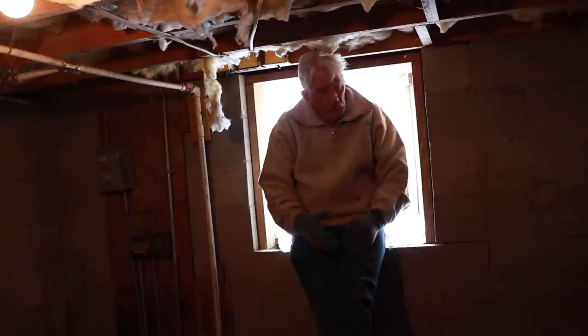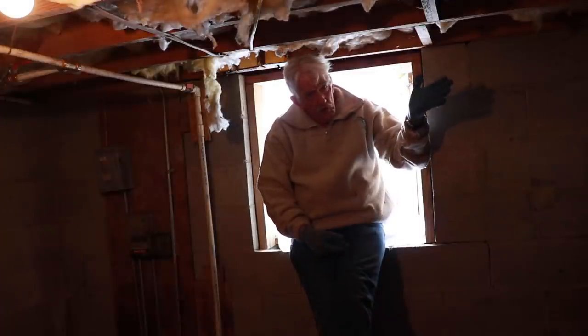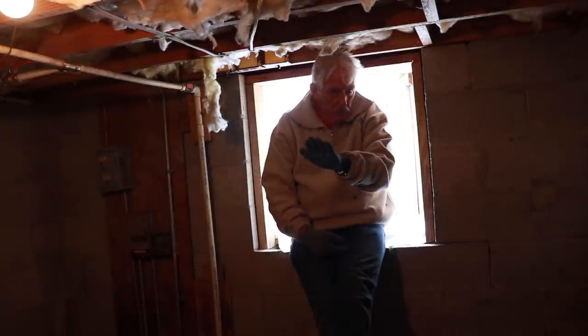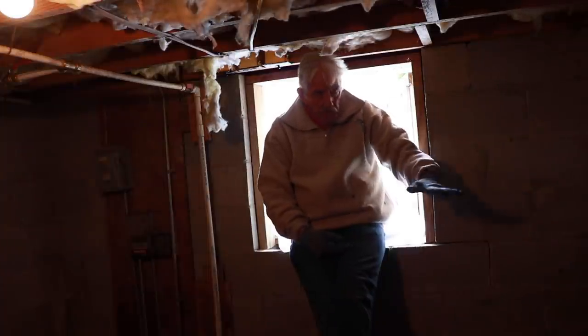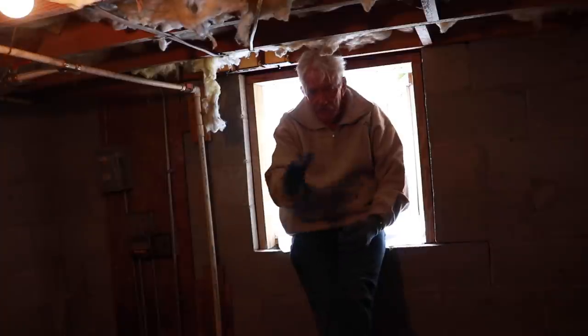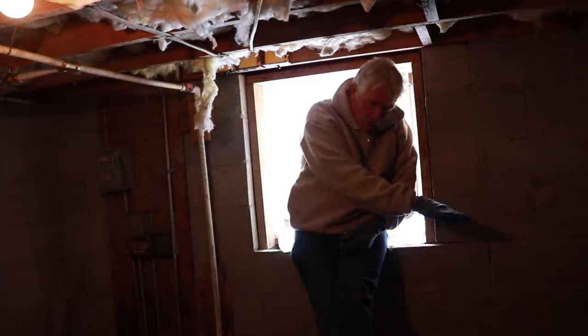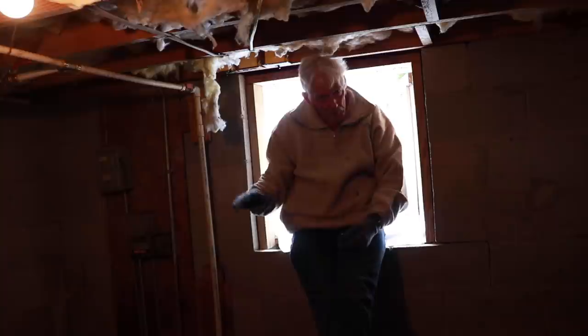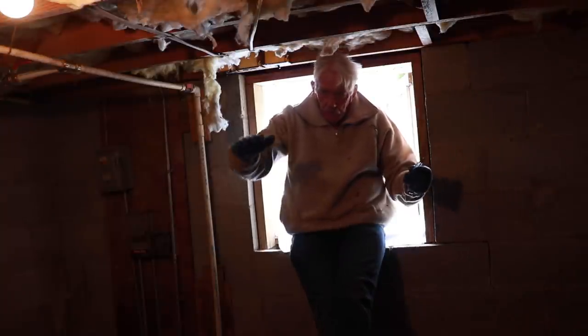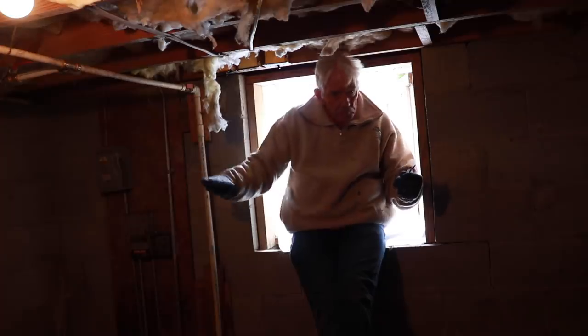Out there, your vent is down below. Yeah, no, we got to fix that. And it's got to be pulled out from the bottom of that vent out away from the house. And sloping. Not only pulled out, but a little slope, too. You can't just dig it out there. It's got to slope all the way so it's away from the house and can't come back. What kind of implement are you going to use to do that? The grader or something? Track hoe. A track hoe, okay. It's got a 2-foot bucket on it and you just rake it down. Okay, good. Get it on grade.